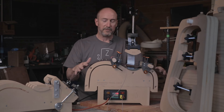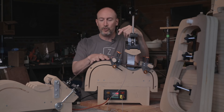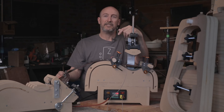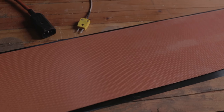Once you get everything set up and ready to go, you switch on the heater circuit and it will fire up the blanket and start everything working. The heating blanket underneath this spring steel is a huge upgrade — it is a fiberglass-jacketed silicone heating blanket. The heating blankets we've seen in the past have all pretty much been silicone, and you use them 10 or 15 times and that rubber starts to heat up and bubble. After maybe 20 guitars that thing has to go in the trash. This fiberglass jacket makes sure that the silicone stays intact.